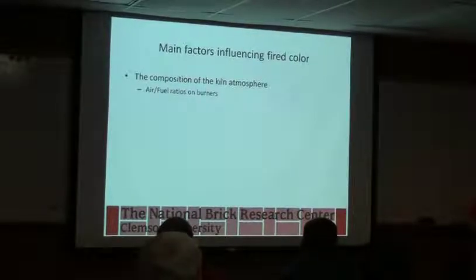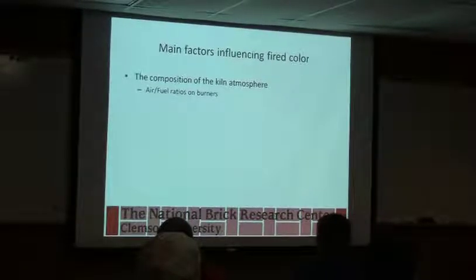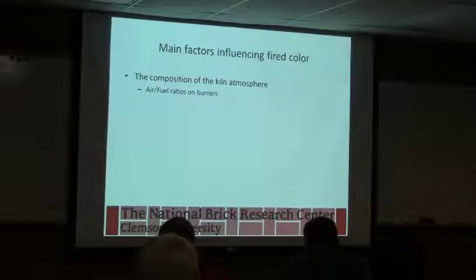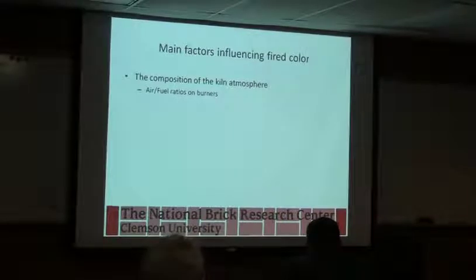I had to do a bunch of carbon monoxide measurements at one point for a study we were working on. I was on top of one of their kilns because they flash continuously, and I started feeling really bad. I got this really bad headache, and then I looked at the meter and thought, I need to go outside for a little while. It was like 400 parts per million of CO, which is actually dangerous for a long period of time if you were standing right on top of the kiln. If you were on the plant floor, it was okay. But keep it in mind if you're ever working around flashing. Be aware of the atmosphere, because you're intentionally creating what you don't want to happen in your home if your furnace isn't operating correctly in the winter.